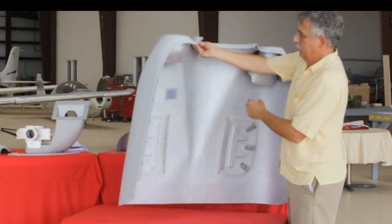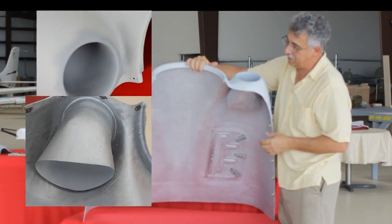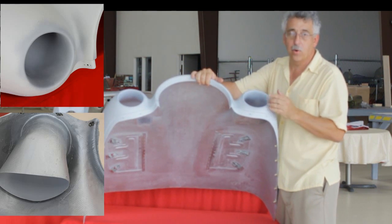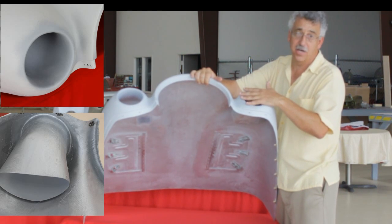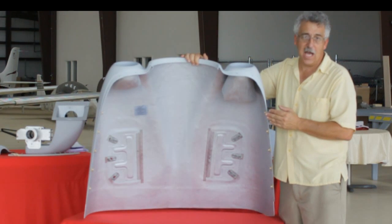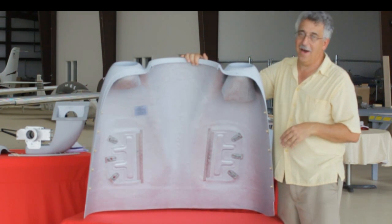The inlet is a much better inlet — round inlet, nice diffuser duct. You can see the duct going aft. You'll notice that the split line on the top and bottom of the cowling is below the inlet. The shape of the split line is very important, and by keeping it away from the inlet, we ensure it stays in good integrity. We are now about two inches lower than the stock split line on the J model. By just pulling the top cowling, you can get to all of your plugs, so you don't have to pull the bottom off nearly as often.